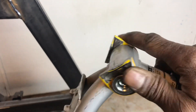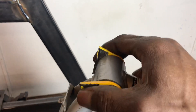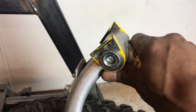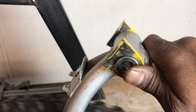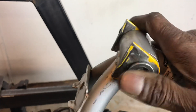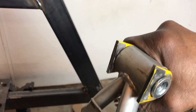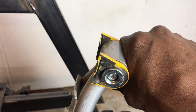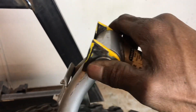One tip I want to share: if you want your stuff to be really accurate, try to assemble it as close to fully assembled as you can before you start welding. That way when you put it up, everything will be lined up. When it starts to warp a bit, the piece will hold itself together so it doesn't get out of whack.